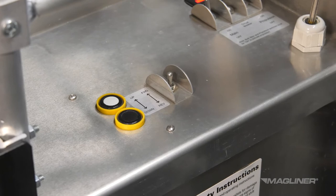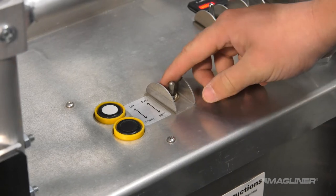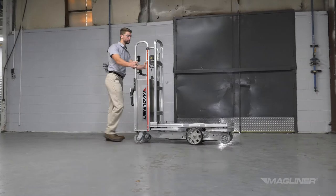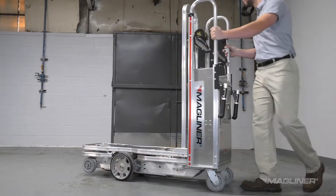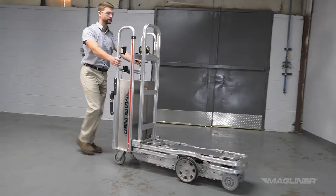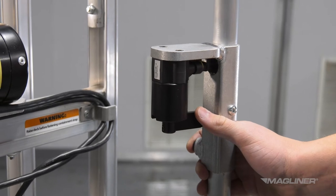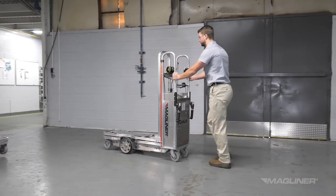Use the directional switch to indicate either forward or reverse movement. The unit can be driven forward when the switch is pushed upward or in the middle position. The switch must be pushed backward for reverse. The CoolLift is always in manual push mode except when the throttle and interlock button are engaged. The throttle interlock button prevents accidental powered movement. The interlock button must be pressed before the throttle will signal the propulsion system to move. Slowly press the throttle forward while the interlock button is held to begin motion. Once the throttle is engaged, the deadman switch button cannot be released without inactivating propulsion. If released, you will need to fully return the throttle to its home position and repeat the preceding steps to reactivate the propulsion assist feature.